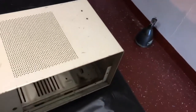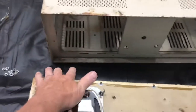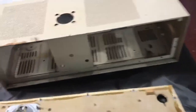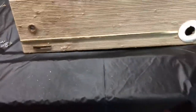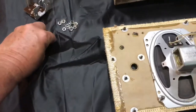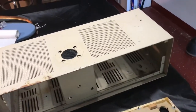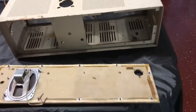As I talked about in part two, this cabinet has some rust here on the edge and down here, so I've decided to sand it down and repaint it. I've already taken the speaker grill out along with the front trim pieces. It's all on one board. Taking the antenna input off — it mounted right here with a couple of Phillips screws. So I'm ready to take this cabinet down to the shop, to my garage, do some sanding on it, and get it ready to repaint.